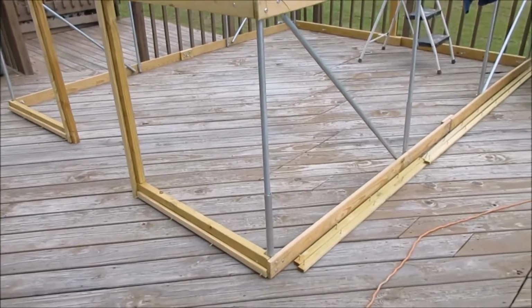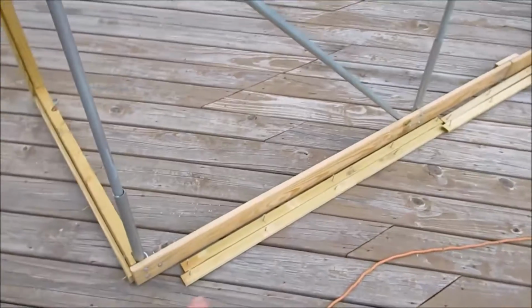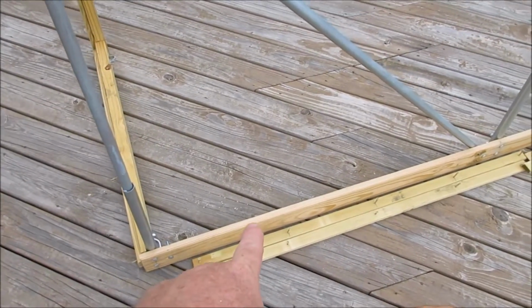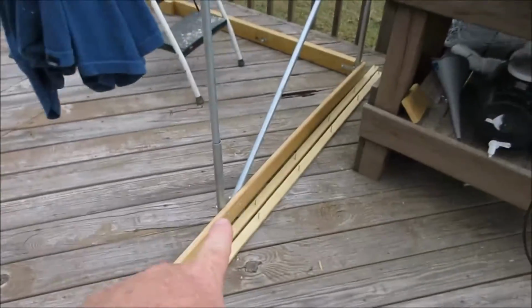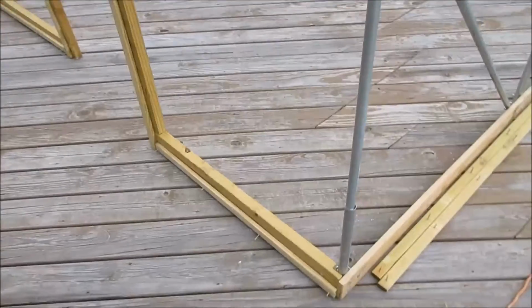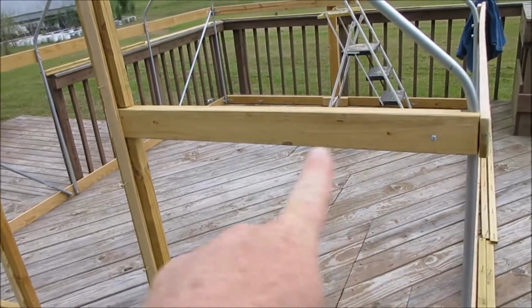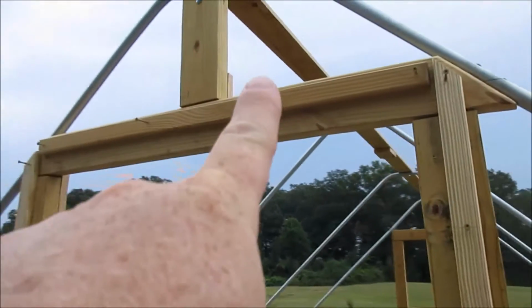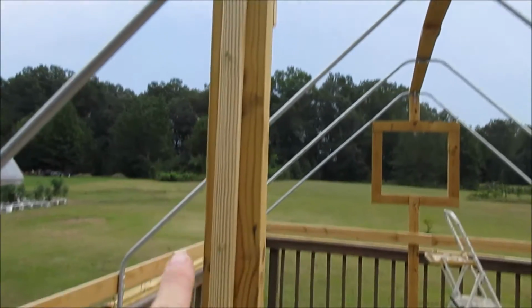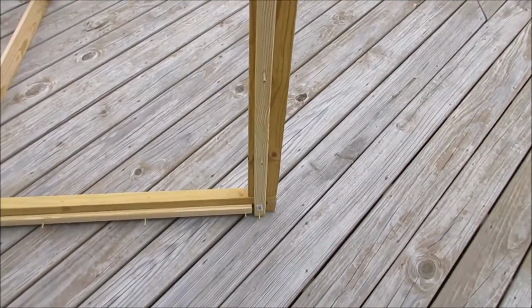What that does is clamp the plastic down and hold it in place. And so now we've created all the strips needed to secure the plastic to the walls. I've got two on each side here. Two shorter pieces, that one goes here, one down here, and then the two longer pieces, same on that. Got that on both sides, left and right. On the front, you've got a tacking strip, a strip used to hold it down there. You don't need one there because this will fold around and the door one will get it. The same thing coming from the top. The door frame will be completely framed in, if you will, held by those strips, the plastic.